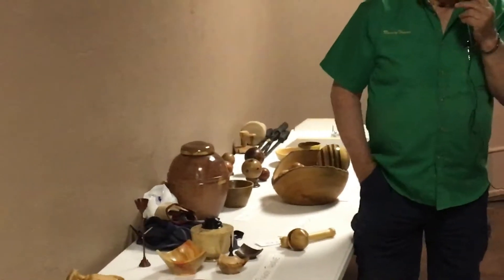I did a demonstration on long-stem goblets a year or so ago, and I had a piece of cocobolo that I made a goblet out of. Yesterday, Dick Markham had given me a piece of cocobolo, and I said I might ought to make something out of it so Dick's feelings aren't hurt. So I made this little long-stem goblet out of cocobolo. If you ever turn one of these long-stem goblets, that's fun — but it's quite a challenge. I put a sealer finish on it. Dick said I could friction-polish and rub it up, but that stem was too thin.